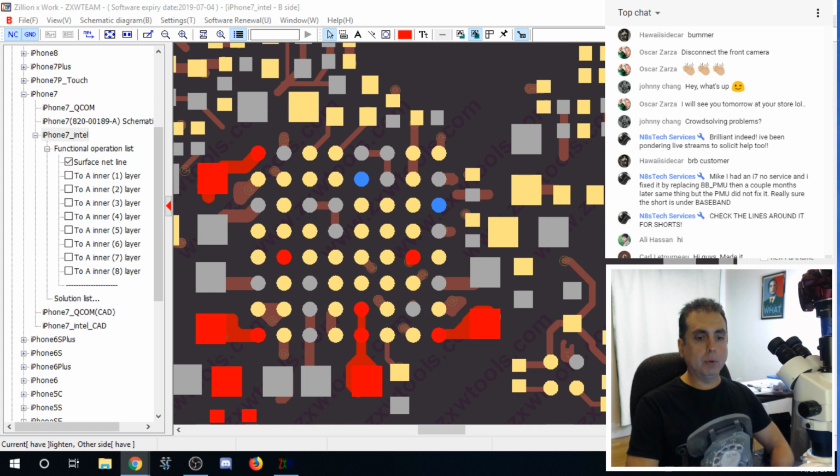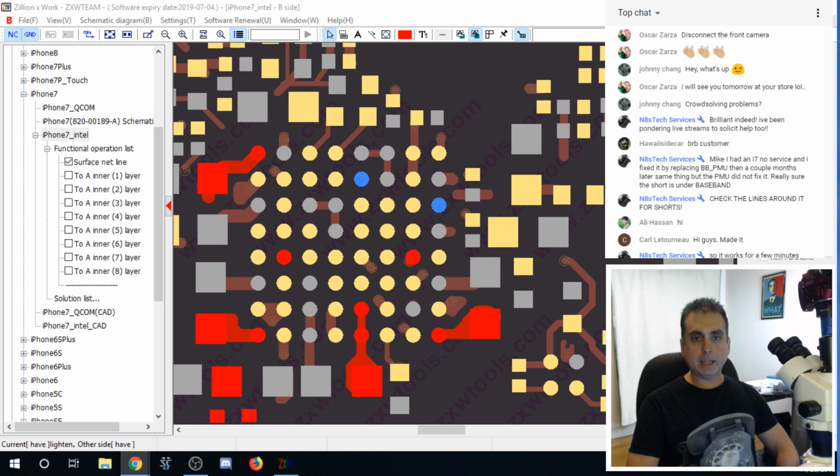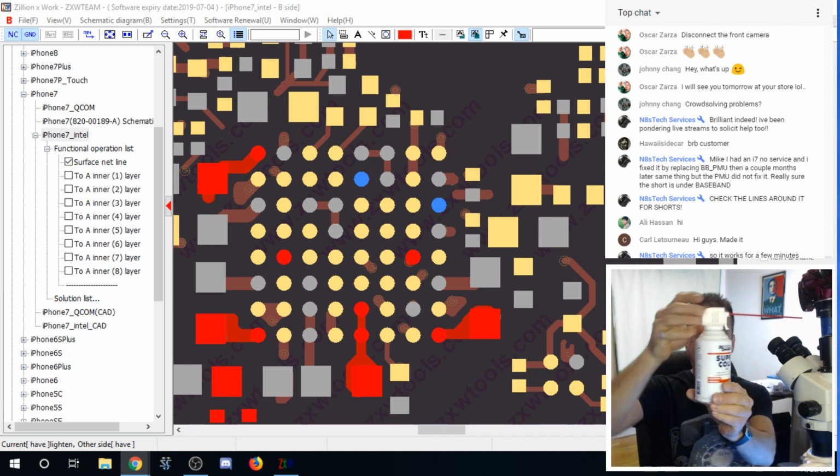0.09. Still taking 0.09. Okay. So what you're saying is on the power supply, before you boot the phone up, you're still drawing 0.09 amps, if I'm reading that correctly. If that's the case, obviously we want to try to track that down. What's unfortunate is if you're only drawing 0.09 amps, it's probably going to be difficult to see the heat. So I would certainly start by feeling around on the phone. If there's not the type of bottleneck that we have in one of the charging MOSFETs, or that other thing where all the power runs through, if you don't have an area like that that's pulling everything into it, then if you don't have a thermal camera, which I don't either, I'm still a huge fan of this stuff.